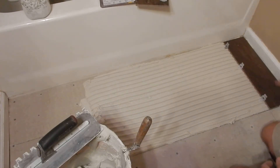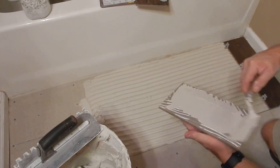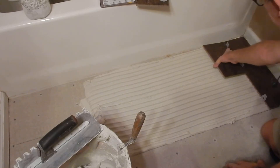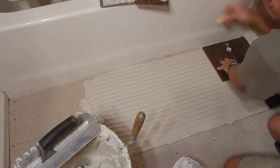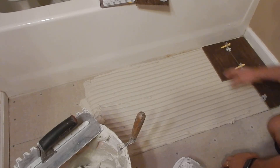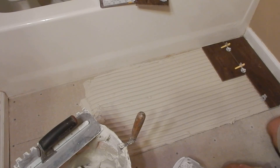I'm also going to put a clip on the end so the next tile can match up with it. My next tile is a shorter tile — I've already cut all of these and got them in order. I'll make sure the cut edge is up against the top, put this tile down, take a spacer and place one here and one here, push it down, take my wedge and push it tight. That's going to bring the top of the tiles flat and level, and I just continue working my way across. As long as I use these spacers in between, I can ensure my lines are going to look straight and uniform.